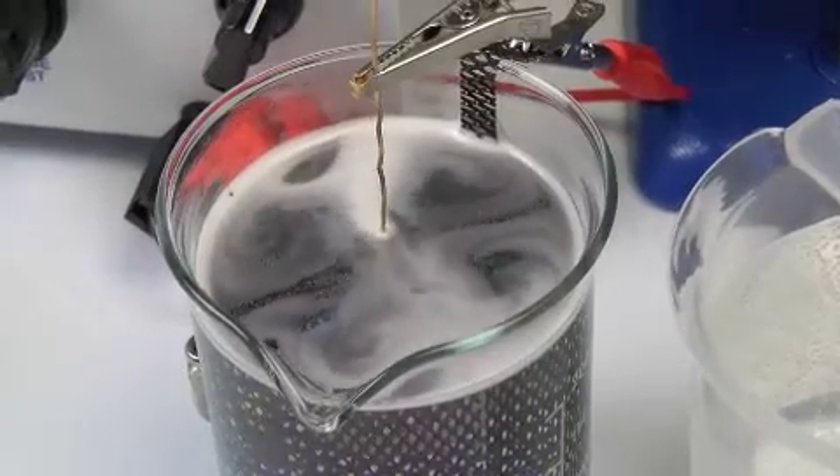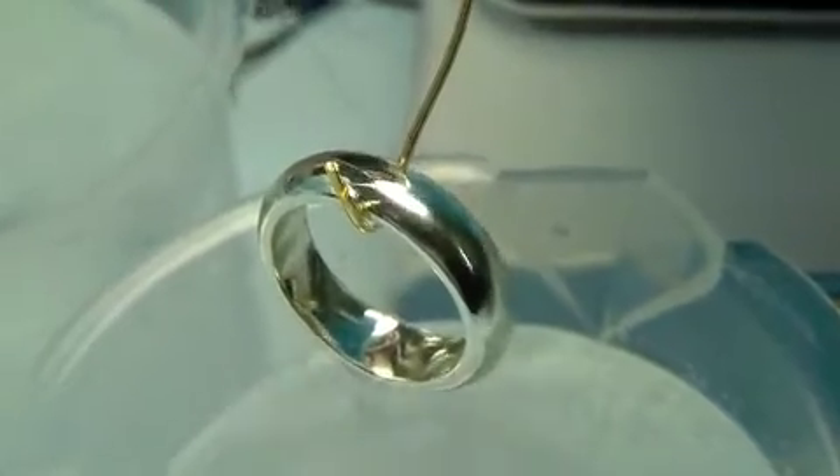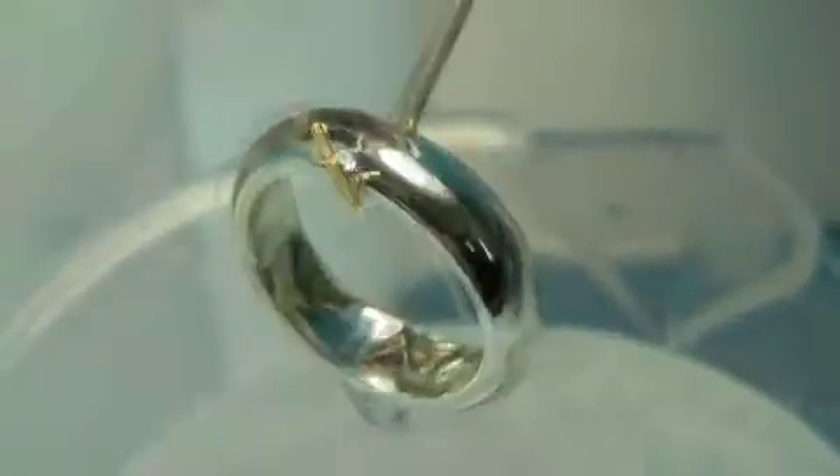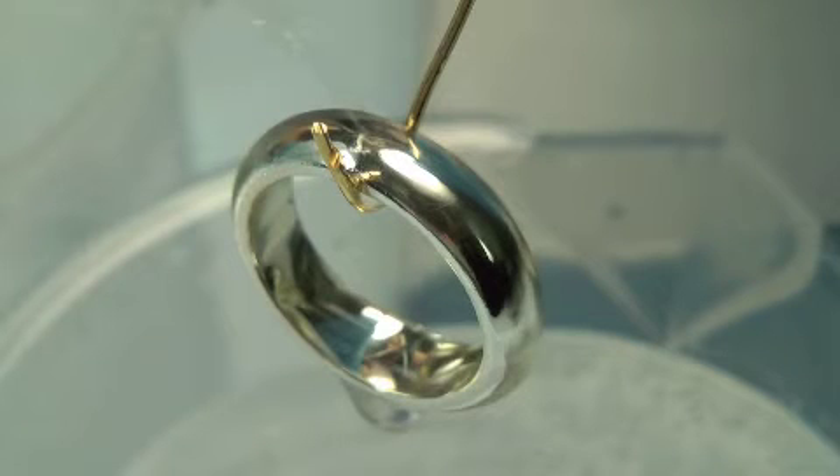We left this silver ring in for about five minutes, passed it through the two rinses, and then did another water break test. Now the water doesn't collect into droplets but forms a continuous sheet over the work, showing that the silver ring is completely clean and making it a fantastic surface for plating.